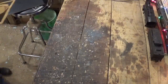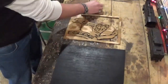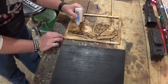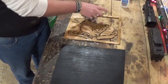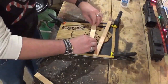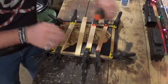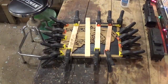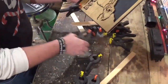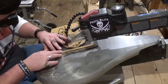We let that dry and then brought it over to glue to the backer board, which is just another piece of quarter-inch plywood painted black. I'm using CA glue without the activator — so I could make sure the pattern on the piece was positioned where I wanted it while gluing up — and then the clamps just locked it in place. I let it dry around five minutes, removed the clamps, and done the final scroll work trimming around the perimeter and removing the excess wood.